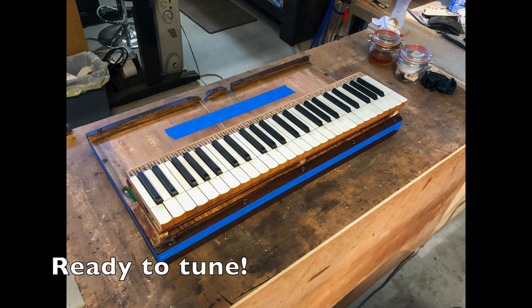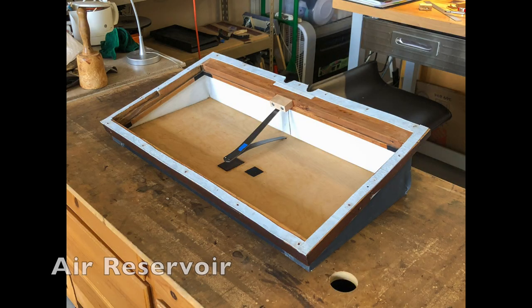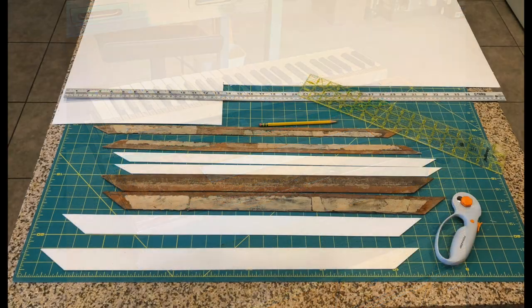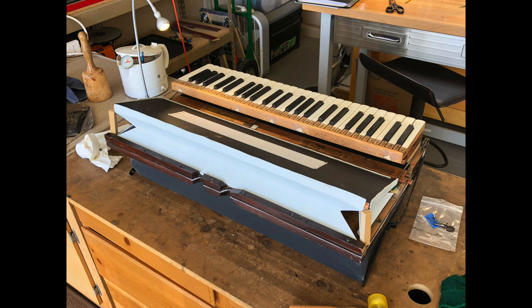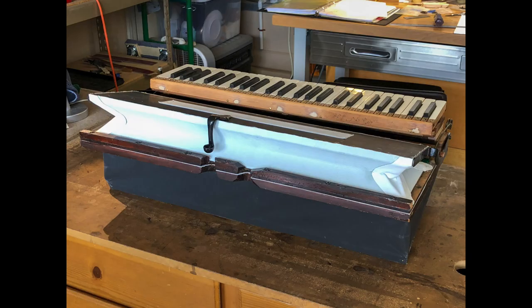Now it's on the tuning bench and time to tune the reeds. The air reservoir is completely disassembled, cleaned, and new hinge material installed with new bellows cloth all the way around. A new leather flap valve separates the reservoir below from the exhaustor above. The exhaustor was made from leather with stiff ribs similar to the old pressure harmoniums. New ribs were cut using the old ones as a pattern. This approach is much more complicated than simply wrapping the exhaustor with bellows cloth. The exhaustor had been replaced in the 1951 work, so there was some guesswork involved as to how to attach the leather properly. New gussets were made from gusset leather and carefully applied on the corners to assure a good tight fit.